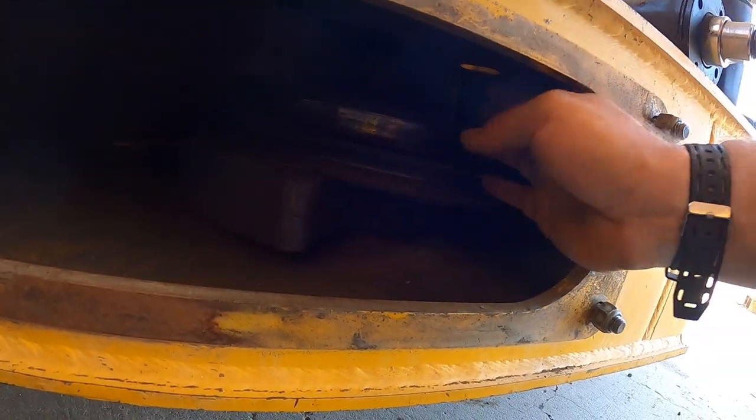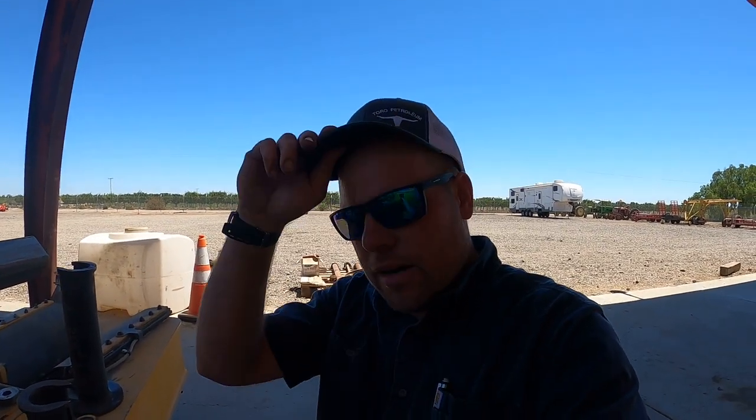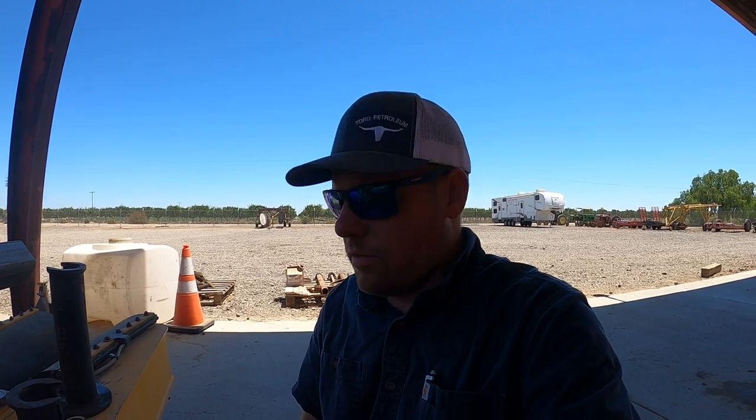There's two thick weights here. Don't ask me how much they weigh, I don't know. And then there's a set of top weights right here. You can change your shake pattern with different weights, different sizes. So we have what you call the standard almond pattern. If you get into walnuts or bigger trees, you'll put bigger weights in them. But this seems to work well for us.